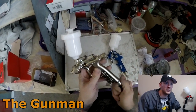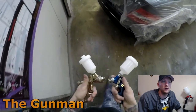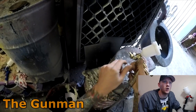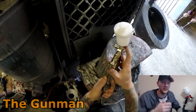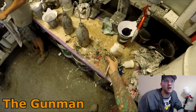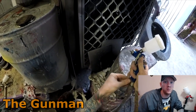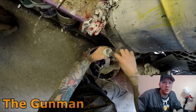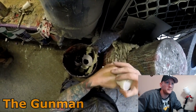The lack of an air adjustment valve is definitely not a plus for the ANI. What I'm actually forced to do here, just for the sake of adjusting the air, is crimp the airline. But if I was to get serious about using the gun I would probably put a cheater valve on it. The other option would be to lower or raise your pressure at the wall in your spray booth, or on your compressor if you're doing it at home.